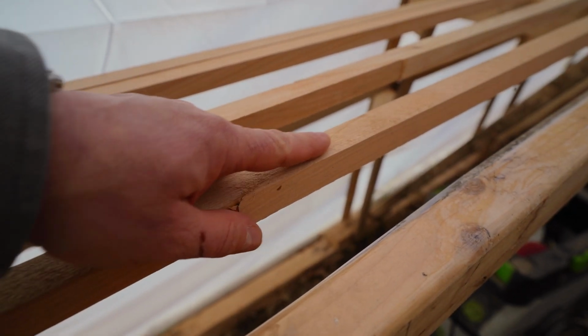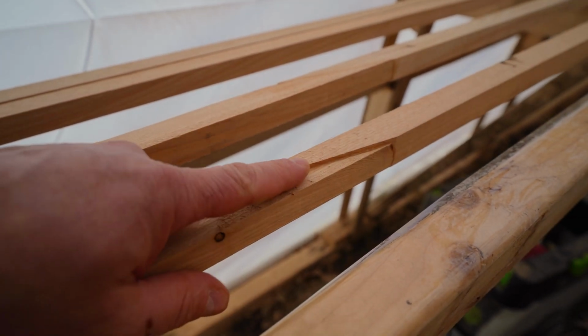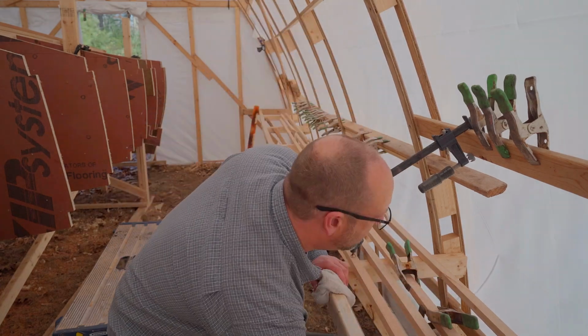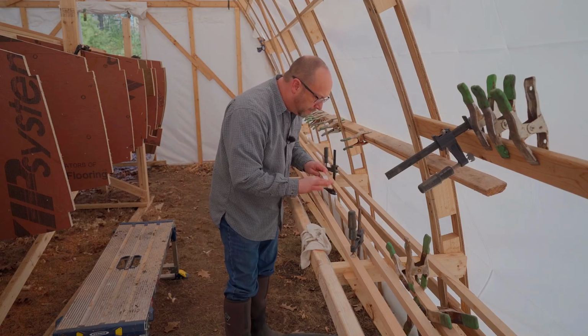The bottom edge is going to wind up being uneven because of how we went about ripping the strips. But all these are going to get fed through the planer and taken down to their final, I believe it's 11/16 inch thickness before they're offered up to the boat.